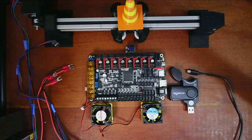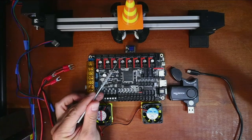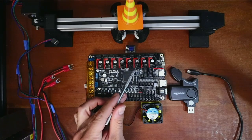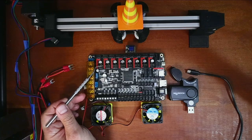Today we're going to talk about how to install the TMC 2130 with SPI on the BigTreeTech Octopus. We have our X stepper, Y stepper, Z stepper, E0 through E4 steppers. They can be used for other things, but what we have to examine — because we want to do sensorless homing as well — is what the actual configuration is going to be for our steppers.